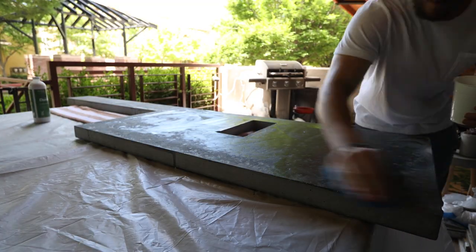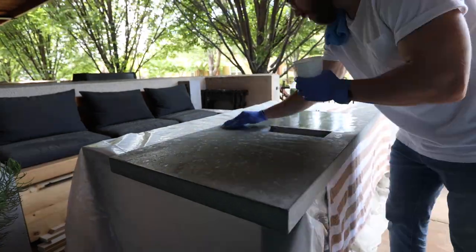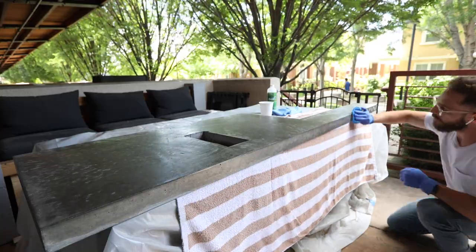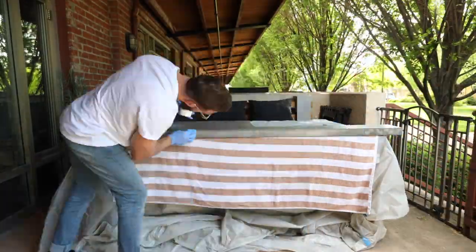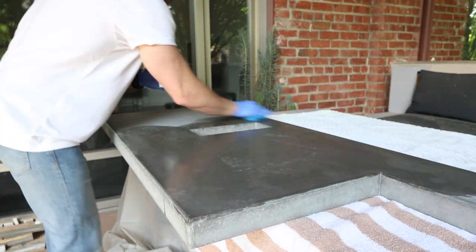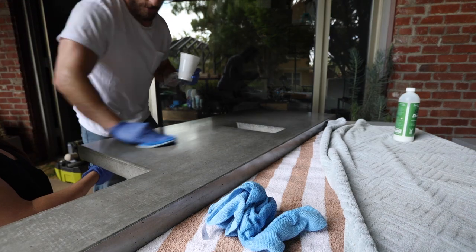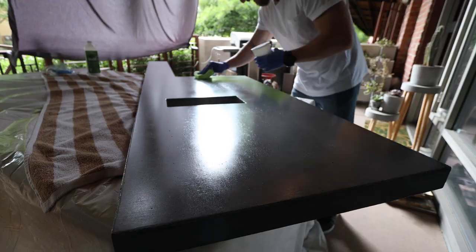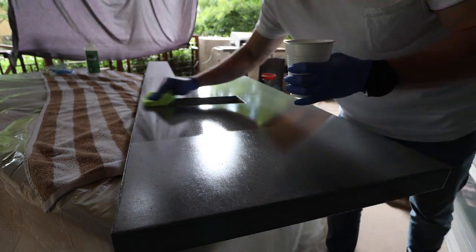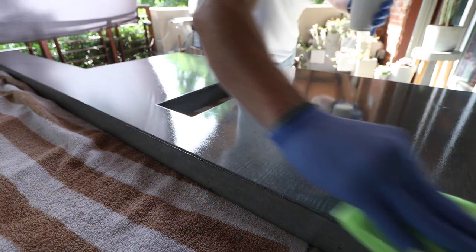The next day it was time to add a finish coat. I started by wiping the surface with water and then let it dry. I will be using a sealer called Tough Duck and I will be applying it with a microfiber pad. I started with the bottom and back edges, wiping it on in one direction. I let that dry for about 30 minutes then added a second coat in the opposite direction, perpendicular to the first layer. For the most important part — the top and front edges — I wiped down with water, then added the sealer the same way, using a criss-cross technique. This method will provide superior protection. I repeated this process for a total of four layers and the final product was perfect.